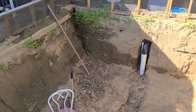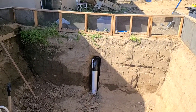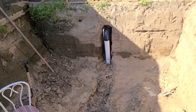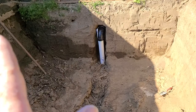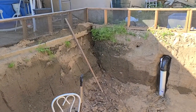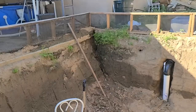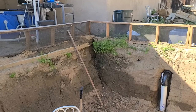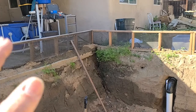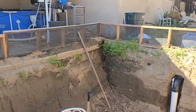The dirt that I need to compact is actually too wet so it won't compact well. I got as much of that out of the way as I can, and the area over here has dried out. Once I'm ready to put the underlayment and liner in, I'm gonna pack and moisten up those voids. I think I'm gonna put together some kind of diverter — maybe a bunch of two-by-fours to stop it — and put some scrap EPDM pond liner cut almost like a gasket with weights on it, so it'll stop the majority of this water from coming in and creating voids behind the liner.